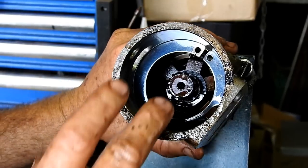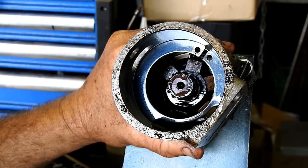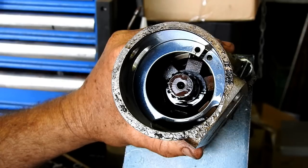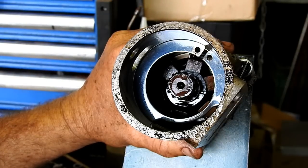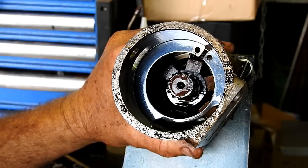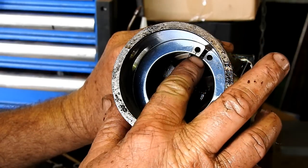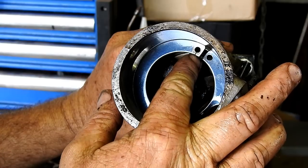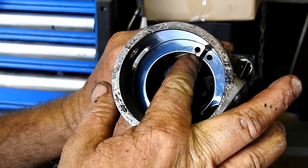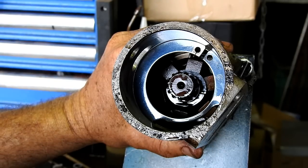And when they pulled this pump off, the fella said to me, oh, we watched your video on how to time your engine, as in some of the other engines, like the 65 pump we did and the 135 pump video we've done. But he said this was out a little bit, probably an eighth of an inch. Well, they were probably lining it up to the edge of the circlip where they need to come back to that little line. We don't have to pull that out at this stage.